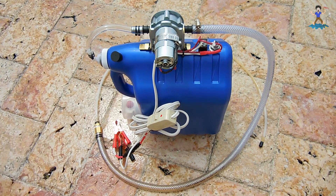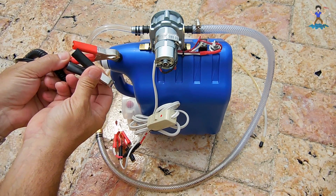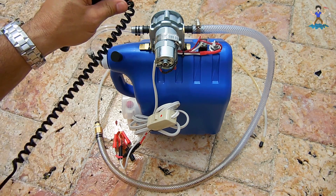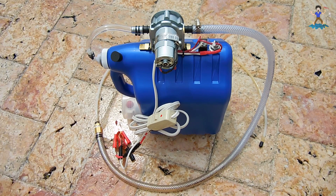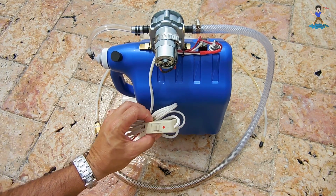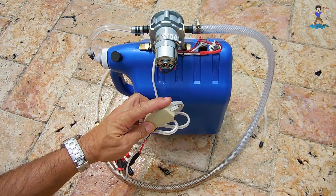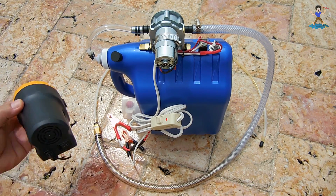When you purchase this oil pumping unit it comes with a cord that's not too long and has alligator clamps. I wanted a much longer cord, so I used a 16 or 18 gauge extension cord that can easily handle up to 10 amps, put clamps on the end, and added an inline fuse holder with a 10-amp fuse inside. I also added a red inline line switch — it's a 5-amp switch that cuts right into the cable very simply.